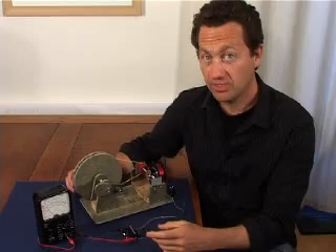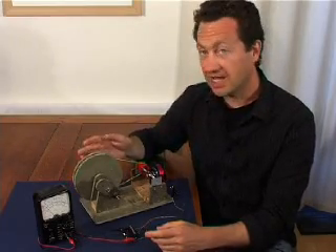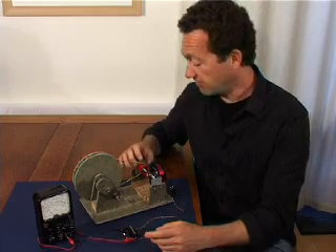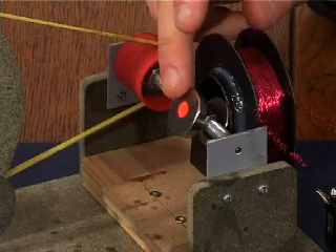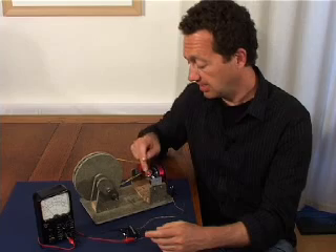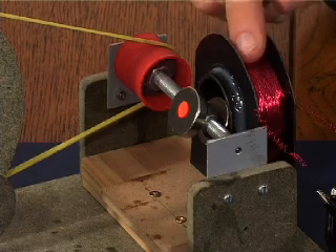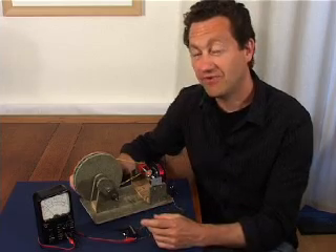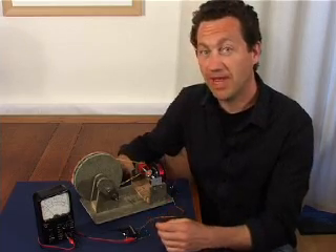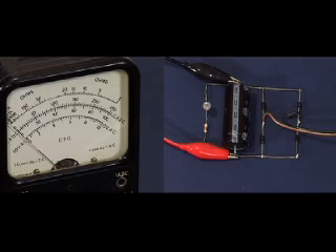In summary, I've got a large pulley made out of scrap wood, a little tiny pulley made out of bottle tops, some strong rare earth magnets at about one tesla strength on the surface, a thousand turns of wire, and a very simple little diode circuit. That will produce about 5 volts of DC, suitable for powering our electronic devices. We should be able to see that on the meter when I turn the handle.